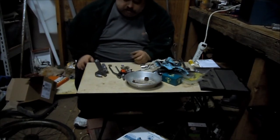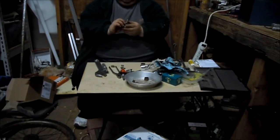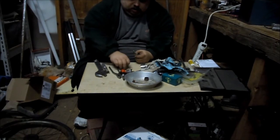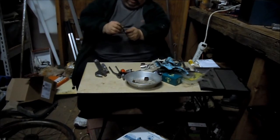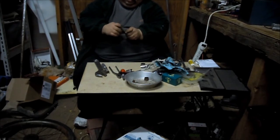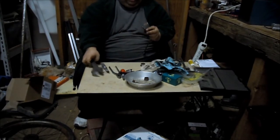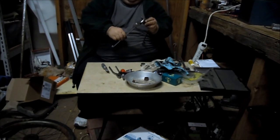We'll have room to get the hole. So let's put it back together. Bolt. Washer. And another washer. This bolt has a shoulder, so you need to hold it up where there's threads. This is a 9/16 bolt that I had laying in a bolt bucket. Luckily I have some of that stuff around. And tighten it up pretty tight.